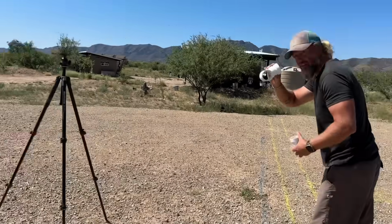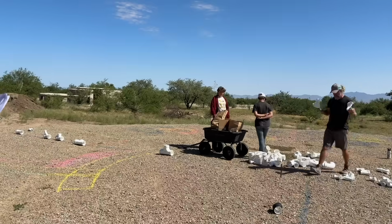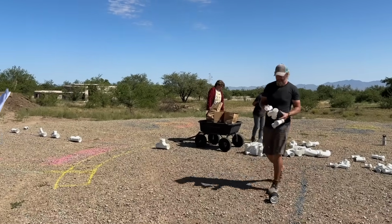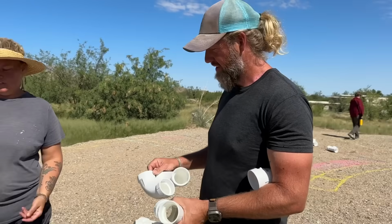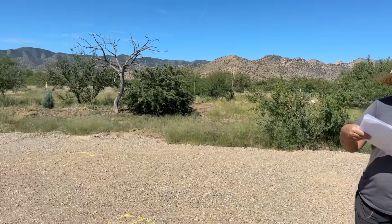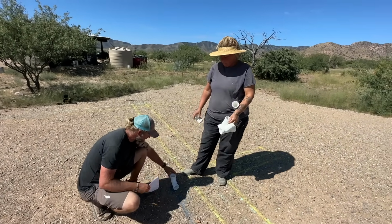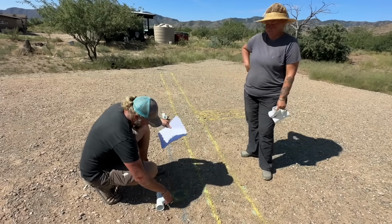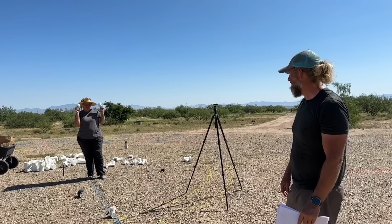A 2-inch cleanout before we go under the wall. Is that right? You need two 2x2 Ys and a 90 2-inch sweep. Sorry, your drawing is totally different than my drawing, so I'm having a really hard time trying to figure out. Right, so this is the end of it. It just goes here and it goes straight up to the sink. The line is gonna be more like here. And then you have your sweep. And then sweep. You go like that. Okay. Yeah.